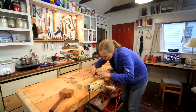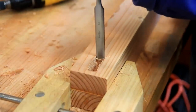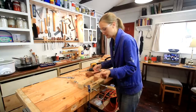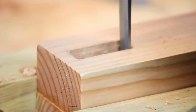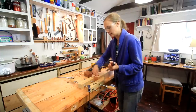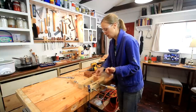That was all the cuts needed to make this tenon — got all four sides cut and ready to be put into the mortises. Now I am preparing the mortises, starting with a drill and finishing with a chisel for the legs. There are a lot of these mortises to do — sixteen all together — but this wood is quite soft and easy to work with. To avoid over cutting I am using a chisel that is five-eighths, and my tenon is going to be just a touch larger, so that way I am avoiding over cutting and making sure I get a tight fit.